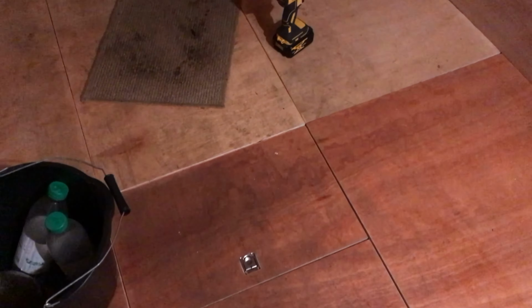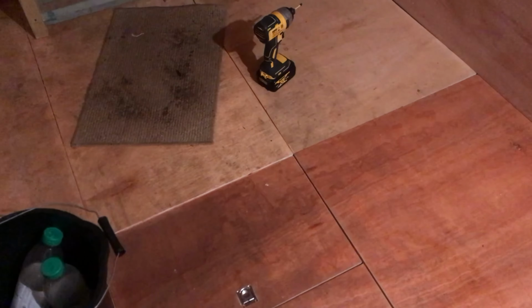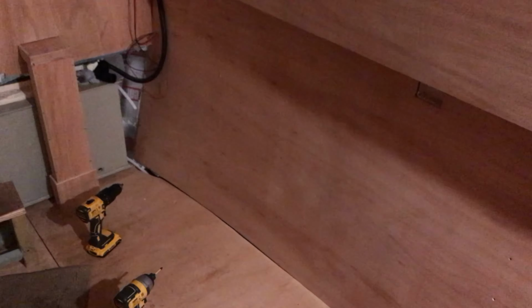You can't see it anymore, but I had a separate photo. Here is where the fireplace is going to be, and I've put a number of extra bearer joists under there because, quite frankly, having lifted it, I know the fireplace is pretty heavy. There's another hatch there because there wasn't any ballast under there, and it's good to have access to the bilge in any case. There are the vent ducts for the bow, and again you can't see that. You can just see the pipe poking its way down the bottom, but there's a pipe that's running all the way up to the galley area.